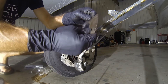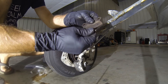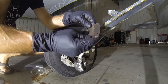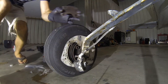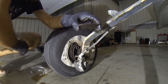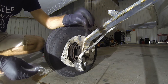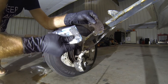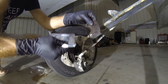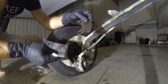All right, backing plate's free of all rivets. We could wire wheel it if we wanted to, but then you definitely have to corrosion-X it. We're just going to wipe it down real good and put some Corrosion-X or LPS3 — some sort of corrosion protectant on there. If you use a corrosion preventative, these backing plates should last you the life of the aircraft — 10, 15, 20,000 hours, whatever it might be. They're not going to go bad. It's just the linings that get replaced every couple hundred hours. If it's with students, it might be every 50 or 100 hours if they're riding the brakes a lot. A private owner can usually go several hundred hours on a brake pad change.